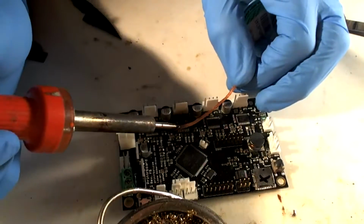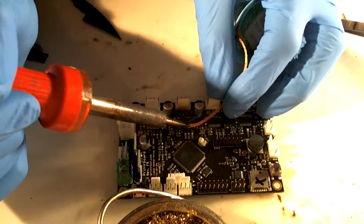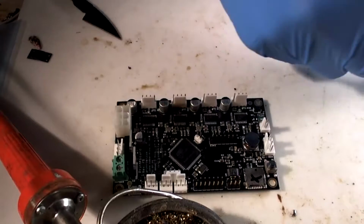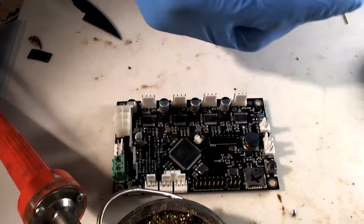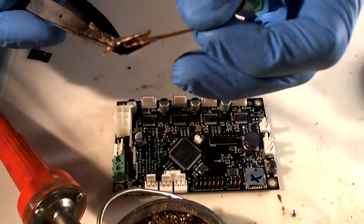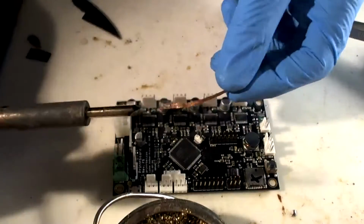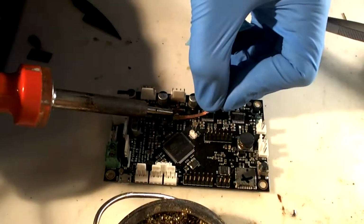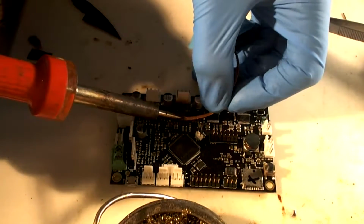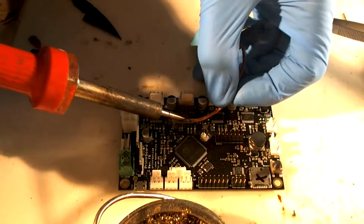It's feeling good. The flux really helps the solder get to where it needs to go. Flux is basically solder magnet. So even though these wicking wires are supposed to work really well, they work really well times 10 if they've got solder or flux. So you're going to just watch this. I'm just going to douse this in flux. Any solder in and around that area is just going to be wanting to come to that braid desperately.